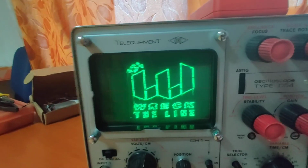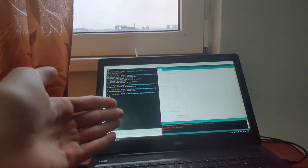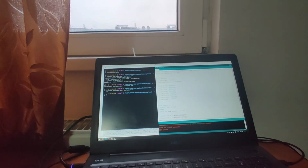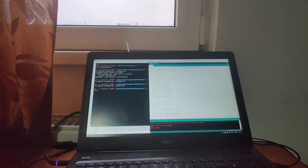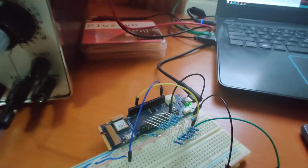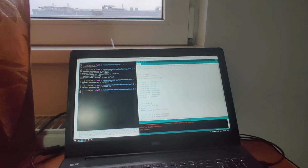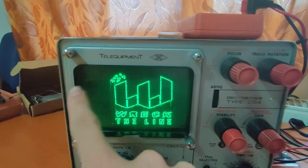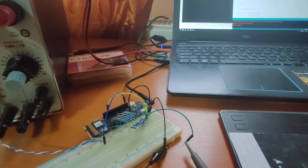In the future, I would like to make some animations, also make some better software which actually automatically converts SVGs or some other format to Arduino programs, so that I don't have to copy between 4 different programming languages. And also maybe design a compressed communication protocol so that I can upload real-time images from the computer to the Arduino without wasting too much time, right? Because I think uploading such a list every frame would be too slow, and you would actually see it draws it and then it waits a bit for the upload, and then it draws it again and waits a bit for the upload, and that wouldn't work. But with some compression, I think it's certainly doable.